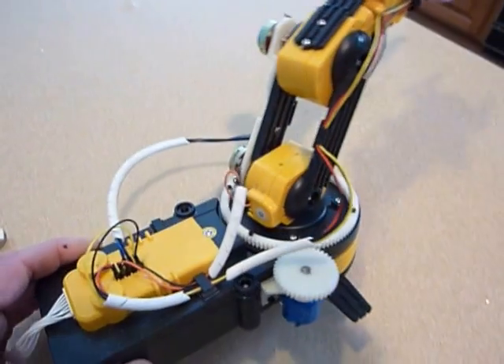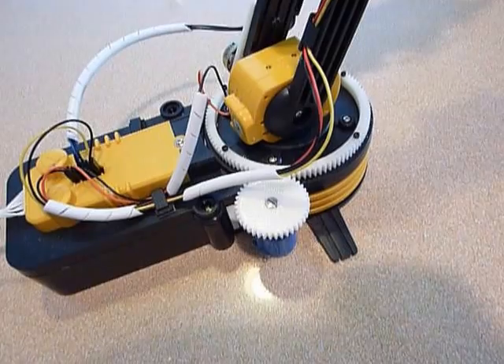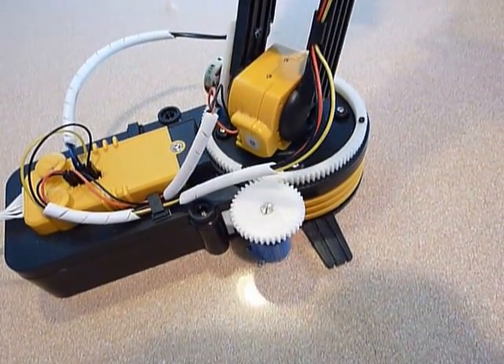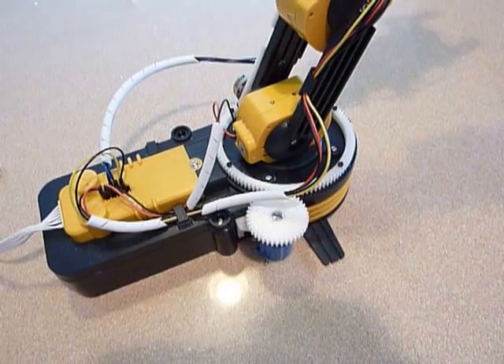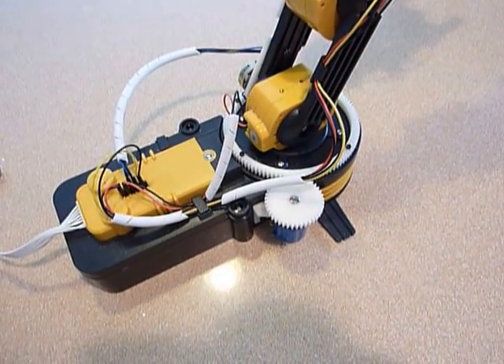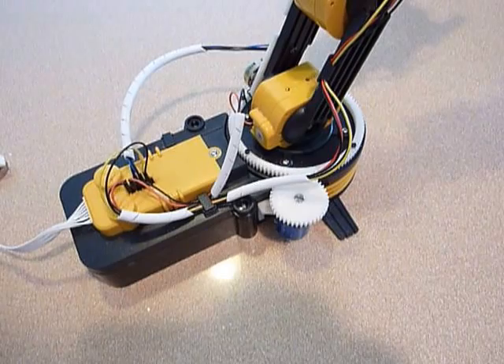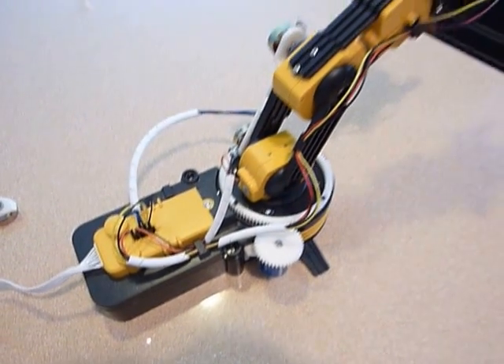Between the two, when you turn the base, everything rotates and the pot turns. You have to go more than one full turn on the pot because of the gear ratio, so I'm using a 10-turn pot — 20k 10-turn — and from that I'll extract the voltage and the position. Hope that helps!